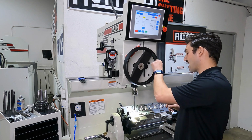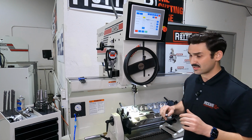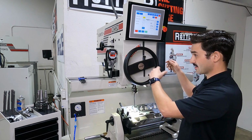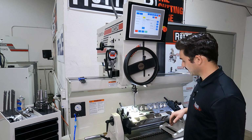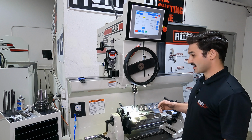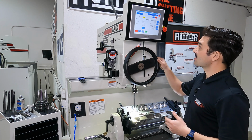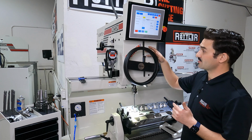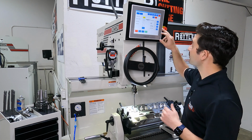And then my float height. When it's in between the retract height and the float height, the workhead's going to be able to just float around automatically. What I like to do with this is use it as a park position. So I usually just go to the top of my spindle travel and come down just a 1/16 of a turn on the wheel and press set.